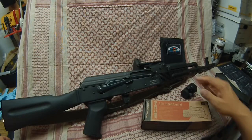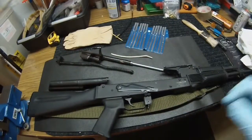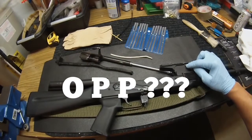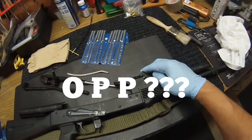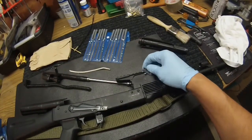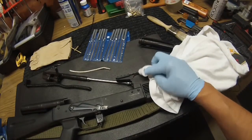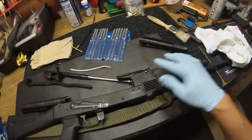I need to make a few modifications and do some disassembly. Standard AK breakdown — I had to grind down a little bit of the bolt right here so I can get the gas tube lever to just flick up. Just a little grinding and a little bit of bluing to try to get that back — might have to paint it.